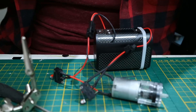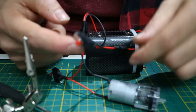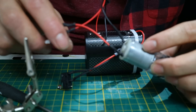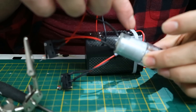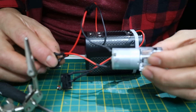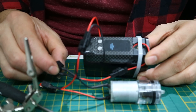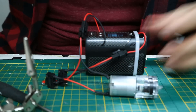So now what do we have? We've rewired the fire button to a different external button — you can make the wire as long as you want — and we've soldered two additional wires to the main battery, wired through another switch to the air pump. I just put the batteries in. If I flip this switch it should trigger the air pump but not the vape box. Here it goes — you can clearly hear the air pump, and the screen is not turning on. That part of the button works. When I press the other button, it says 'no atomizer found' — because the atomizer is over here.